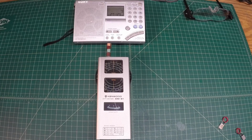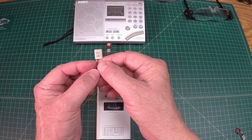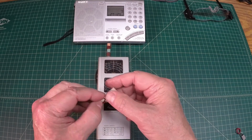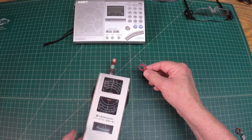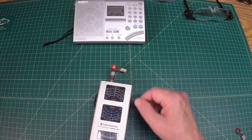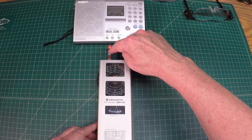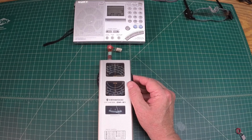Hey guys, let me show you how to use a dip meter. This is just one method. Again, I'm going to really just make a little near field probe and a couple coils of wire. Here's this bad crystal here at 27-125. And you can see I've got a receiver here set for that same frequency. So I've just got a loop here. Typically you wouldn't wrap that coil around the inductor itself here, but for demonstration purposes I'm not trying to get an exact frequency. I just really want to understand if this crystal will resonate.